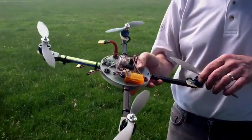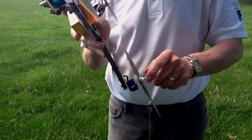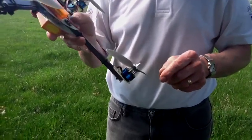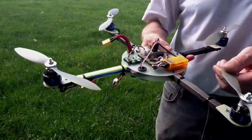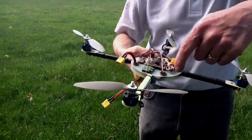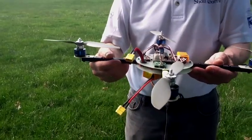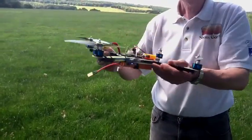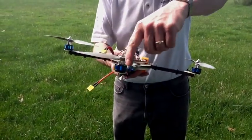What about the motors then? The motors are Hacker copies — approximately about 100 watts each. One thing you'll notice about the props is you've got pairs, because on a quad the props are set up so they all rotate into the centre. Because if you didn't, you'd have an effect where it would want to go one way all the time because of torque. So you've got that one going clockwise and the others counter-clockwise.